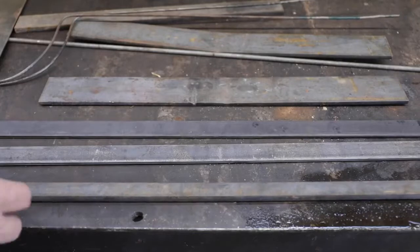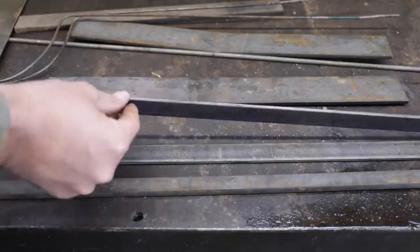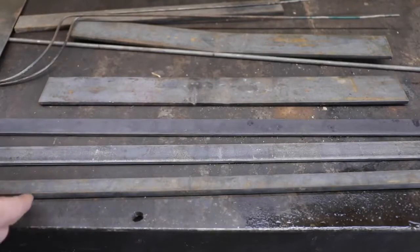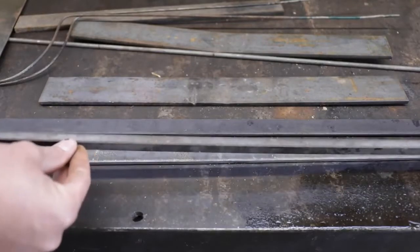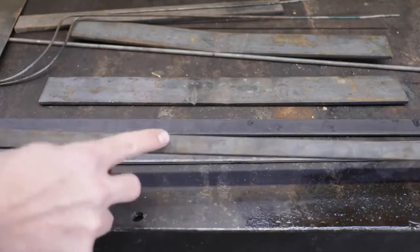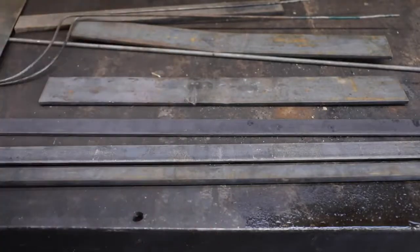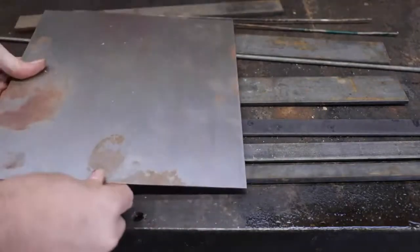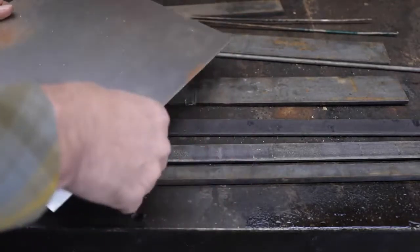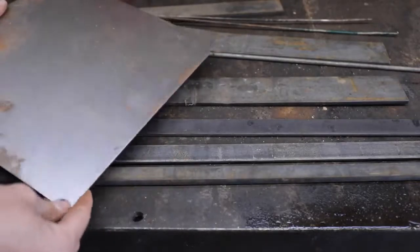The scale of the upright arms is pretty important and I've kind of been going back and forth on this. I was looking at some of this flat bar here, which was just maybe a little bit too light, too delicate and maybe wider than I wanted. I found this here — it's probably a three-eighths thickness or so by one inch or so. I think that's going to have the right look, being that this will be split into two different arms. Then for the cones — the portion that's going to hold the candle sticks — this will be 16-gauge steel that we'll cut out and bend into kind of a cone or a really tight funnel.